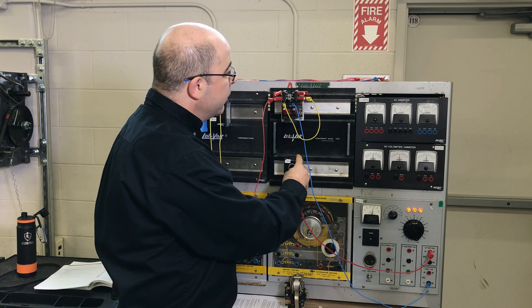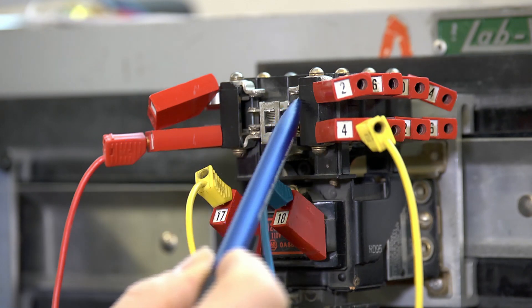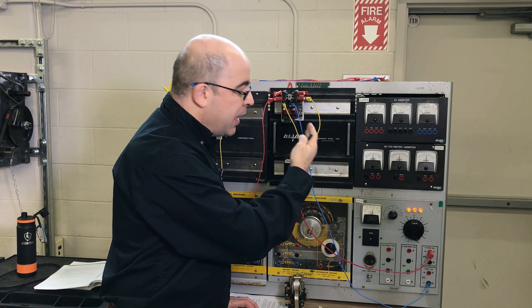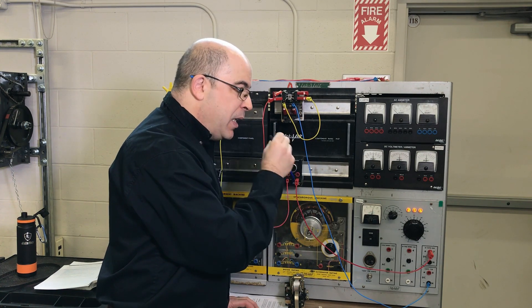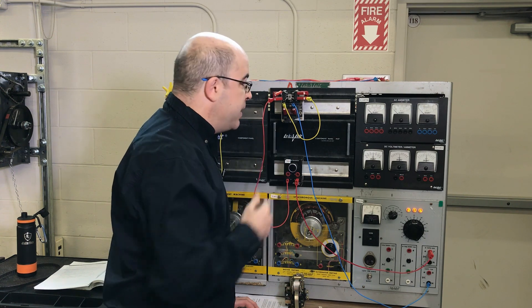Just to recap — that's a lot of arcing. Now we do have a couple of techniques we can use. One is by wiring two contacts in series with one another, which effectively doubles the air gap. It is somewhat effective, but it is not the most effective method of extinguishing an arc with DC current.